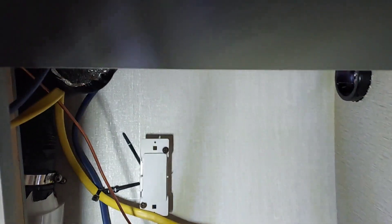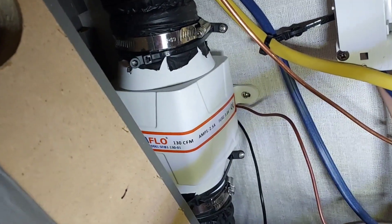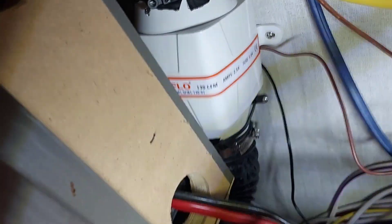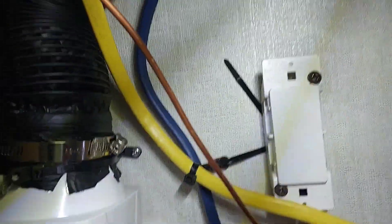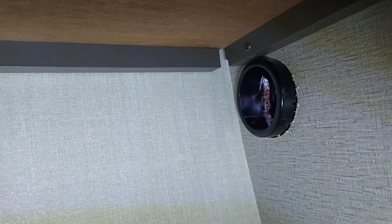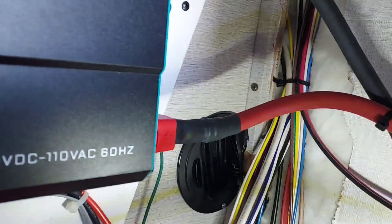We had to make a little change - I had to put the vent that goes out to the battery cabinet up high so it will clear this, because as you can see the top there is really close. I think we're gonna make it. We've got the inline fan mounted - it's not the way I wanted to do it but there is just no access in there. I'll show you what I had to do outside. We got this vent mounted and I had to trim it, which I was anticipating, so I brought some tin snips with me.